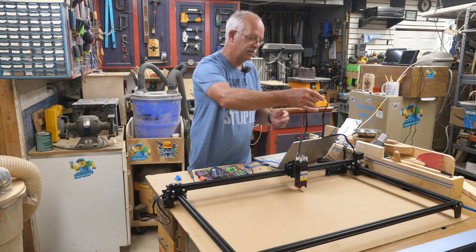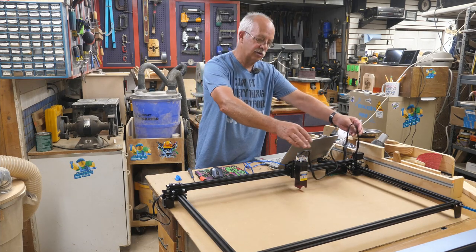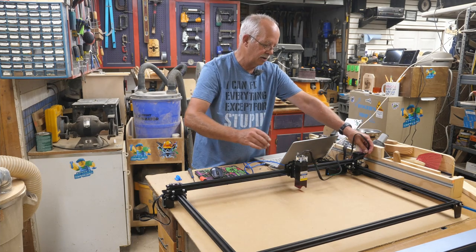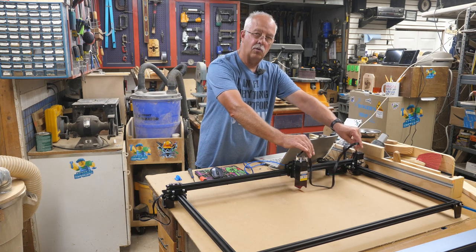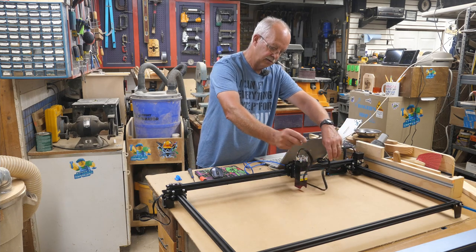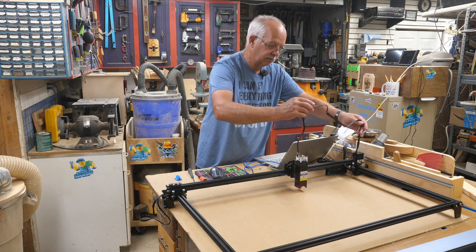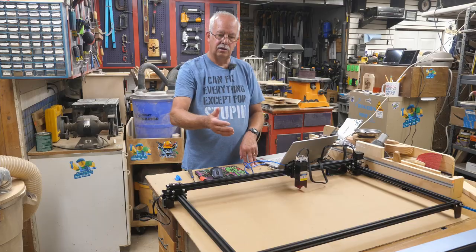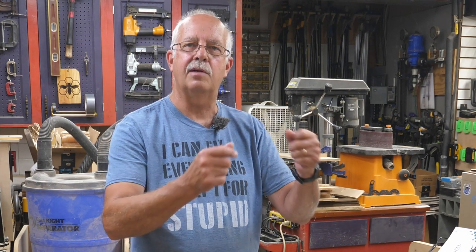Overall, the laser performs well now that I've made the belt adjustments. The cable management is still a nuisance — I had one instance where the cable got between the plate and the limit switch and stopped too soon during auto-homing, so I'm definitely addressing that. The assembly instructions are there but not 100% clear, and some pictures seem to be for a different laser. You need to really pay attention to the things I pointed out. There'll be more videos coming on this laser as I use it to make my long signs. I need to make a baseboard, mount it, and create a spoil board with a grid for the large format. I'll be mounting it using some 3D-printed feet with a slightly wider slot than what I use on my other lasers. Yes, ZB2 did provide this to me to test and demonstrate. Thanks for watching.